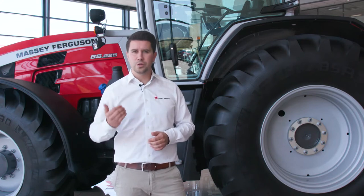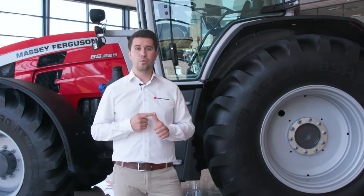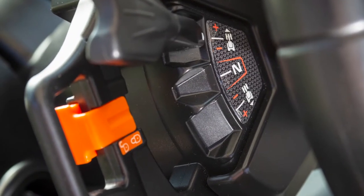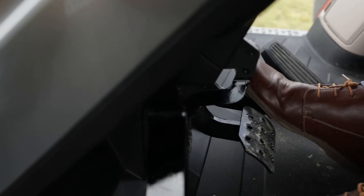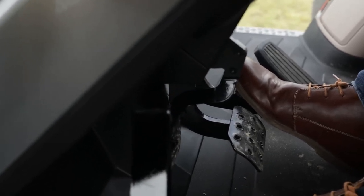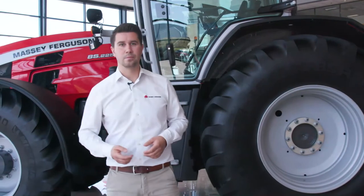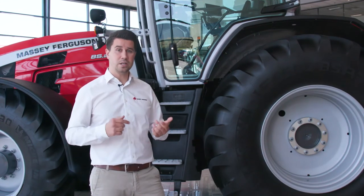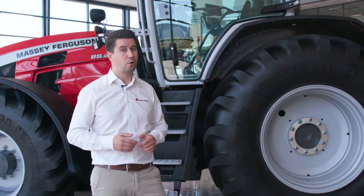We also keep the good features of our current Massey Ferguson tractors. For example, the straightforward power control which allows you to change direction and increase or decrease speed with only your left hand. The brake to neutral with a direct activation switch — thanks to this functionality you can stop the tractor and engage the neutral position simply by pressing the braking pedal. It's logical and easy to use. The eco transmission reaches 43 kph at only 1,250 engine rpm, allowing fuel savings for maximum profitability.